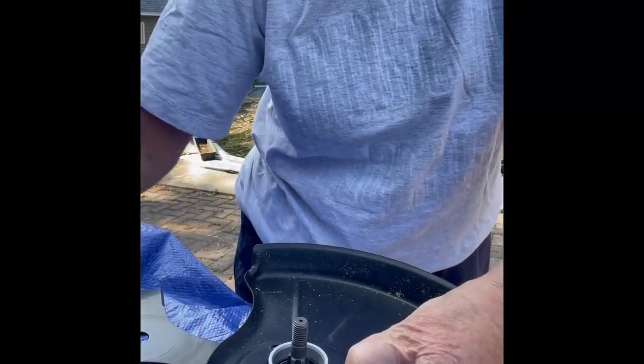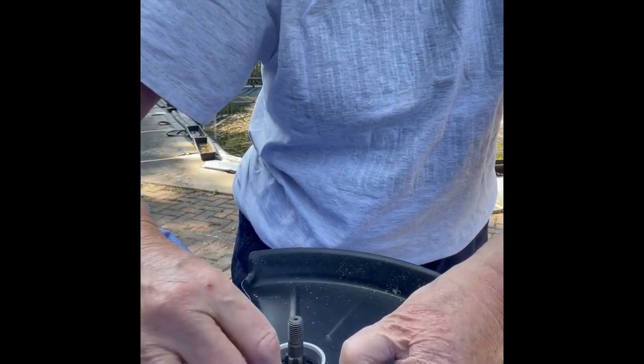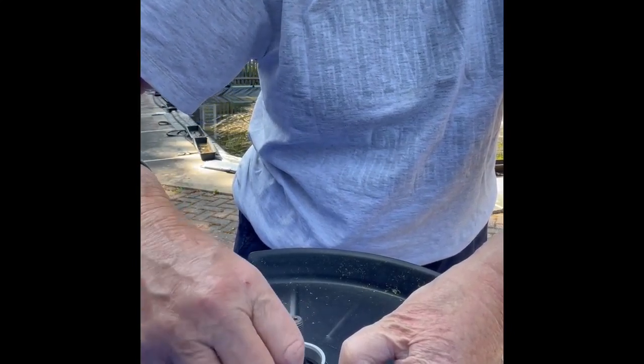And you have the 3 screws or nuts with the lock washer that go in here from the bottom. Go in just like this. Now you must have the lock washer because that will stop them coming loose from the vibrations, and there were a lot of vibrations. So I am just going to stop this while I put in the 3 screws and then get back to you.